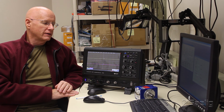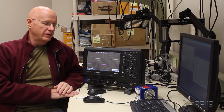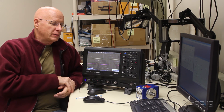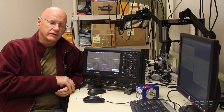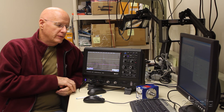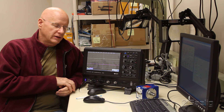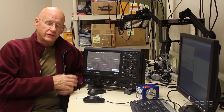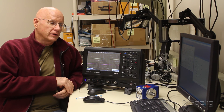Now we're going to talk about software. The transducer, as I mentioned, has digital and analog output connections, as you can see here. If you buy the less expensive model, the analog outputs are available and are usually fixed at plus or minus 10 volts full scale. If you get the 420 series instead of the 410, there are various options available. The transducers we have here for this demo are 421s and they're both equipped with a USB output.